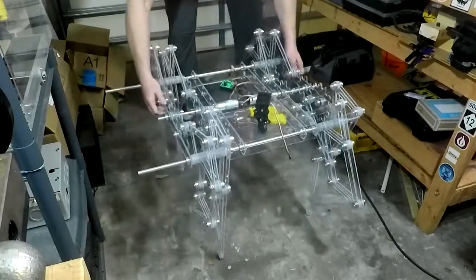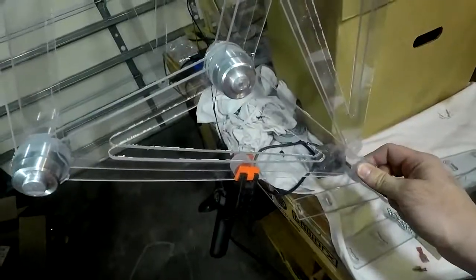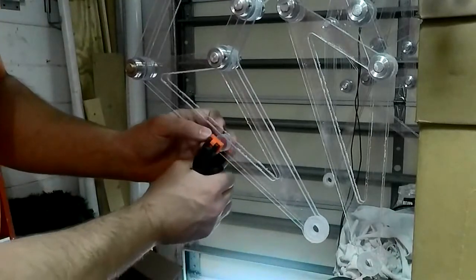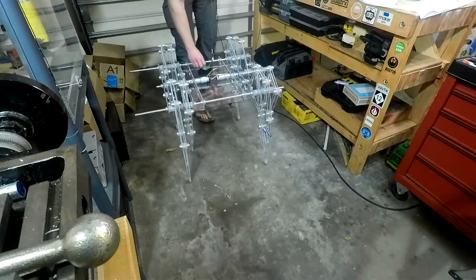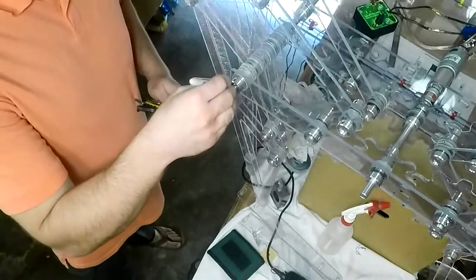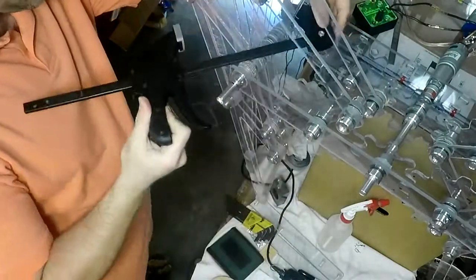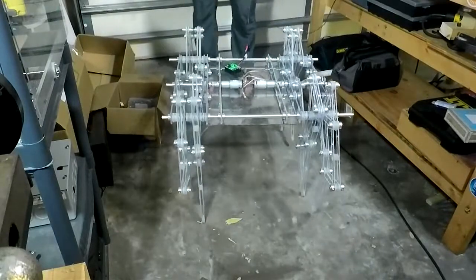At that point it was time to try it out, which was my first failure, so it was back to the drawing board. As you can see, the legs are very strong in the front-to-back direction, but side to side they tend to buckle. I had some spacers already made anticipating this problem — I glued them on, clamped and glued them, let them dry and tried again. But it was still buckling a little bit and just not good enough to support batteries and stuff. My next thought was to lighten things up by cutting off the offset rods, but it wasn't really the game changer I needed. I also tightened the axes down with a clamp to keep things from wobbling, but the problem was it increased friction quite a bit, so I had to turn the motor up to get it to go at all.